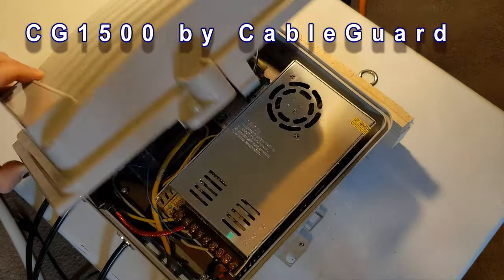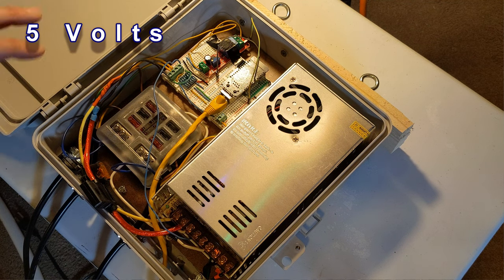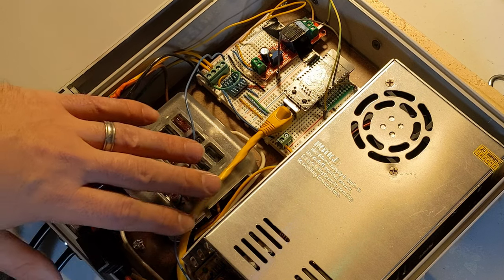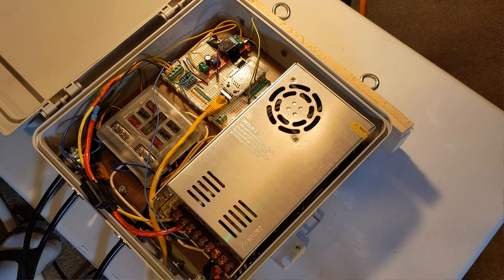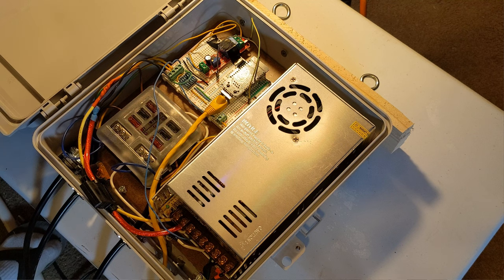First off is the CG1500 box. My entire show is a 5-volt show, so I can power both the microcontroller and all the different components as well as the lights all at the same voltage. I don't have to worry about having a 12-volt power supply for the lights and then a 5-volt for the controller — everything is self-contained. The network jack is physical because the controller I'm using is a WT32 ETH01. Most microcontrollers are wireless and connect through Wi-Fi. However, when I tried to run this off wireless, the images would come seconds after the music and it was poorly timed. But when I purchased the WT32 ETH01 and hooked it up physically, it was much, much faster. I'll have links to that in the description below.